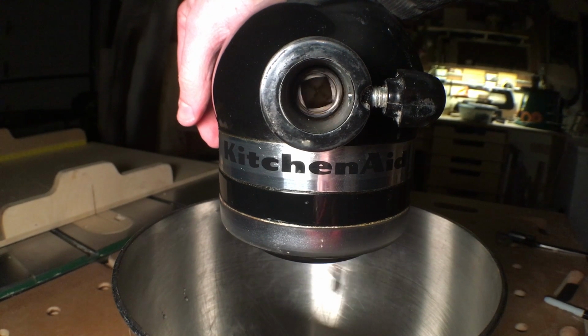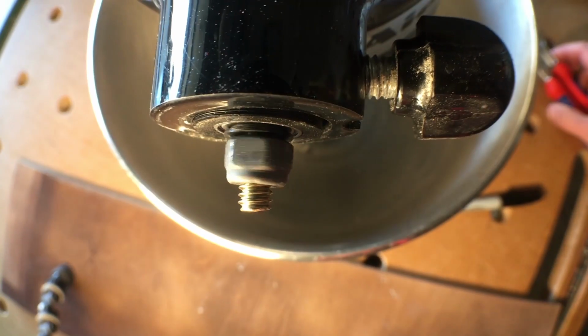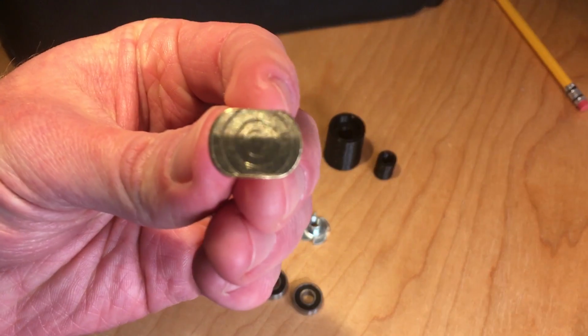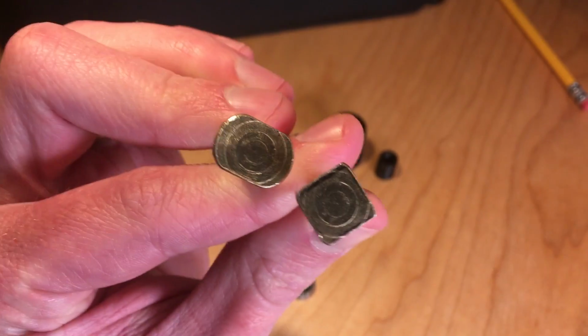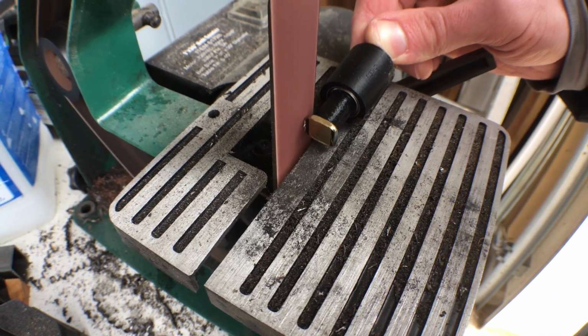So the objective here is just to go from a square hole to something usable. And for that something usable, I chose a 1/4 inch by 20 TPI bolt, in particular a toilet bolt or router hardware T-bolt, 2 1/4 inches long. One dimension is already correct on that. Just need to sand off the 2 wings to make it square.